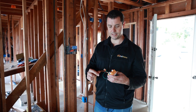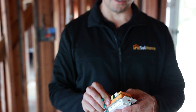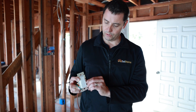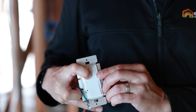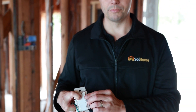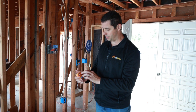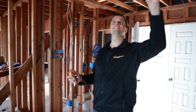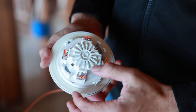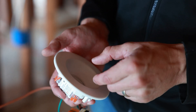These are ATX LED fixtures with his proprietary driver. What this allows you to do is not only turn the lights on and off but you can dim them right here as well, and if you hold it down while sliding it you can change the tuning of the light — you can change the color. By running two circuits up to the fixtures in the ceiling — 2700K for warm lighting and 5000K for cool — there are actually two LEDs in here. It goes through both with different ratios, so it's infinitely variable basically.